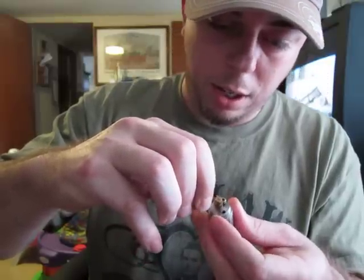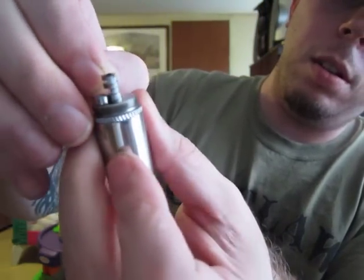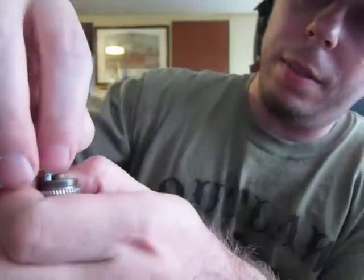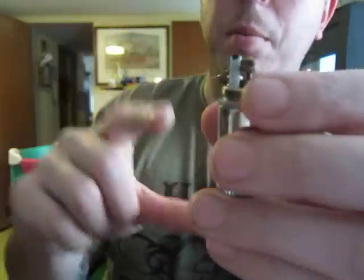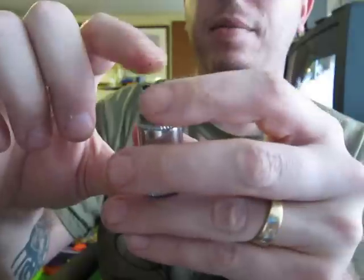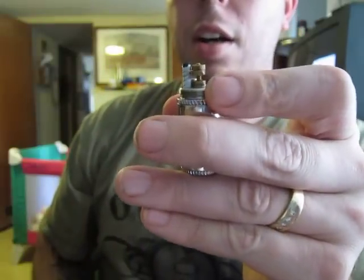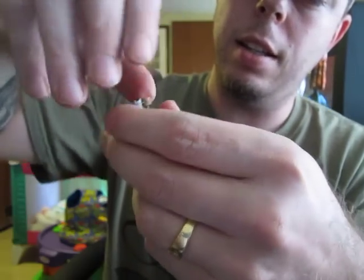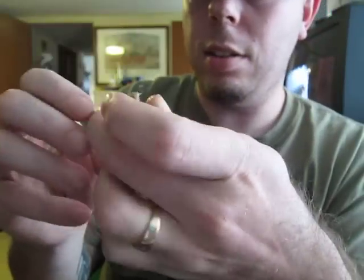Okay, so what I've got here is a three to four wrap, and I'm going to wrap this around the top post counterclockwise. There's just going to be a small little jot over for the positive wire. Then I'm going to tighten down the top nut just so it'll hold that wire in place. Now I'm going to create some separation between the top nuts and the mesh — that's the reason why I say don't tighten this down tight. I'm pulling the mesh over and making sure I have that separation, then going ahead and cranking it down tighter.